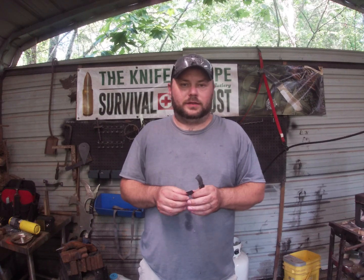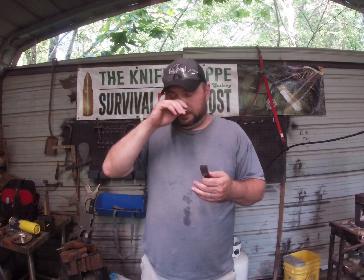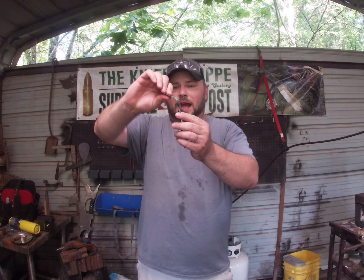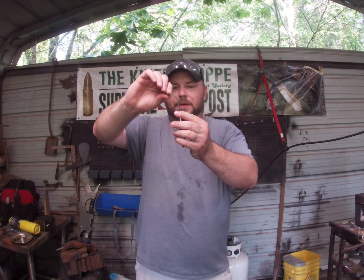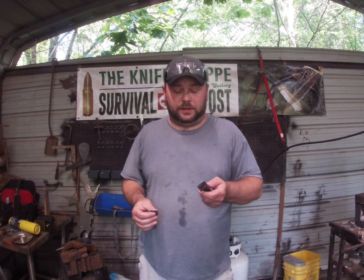A softer wood, you could probably do a little bit harder wood, but understand there's a chance it could pinch on the blade and bend your blade if it's something like hickory or ash that is going to be able to pull tight around your material if you're not careful. And it could potentially, again, bend the blade. But because it bent so far, I wouldn't be worried about it if it got pinched, that the blade would break. And that's my honest opinion on that.